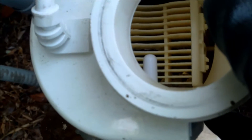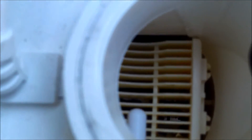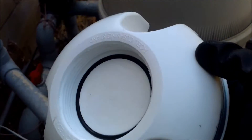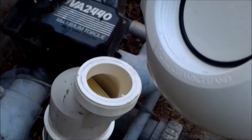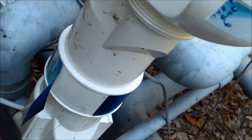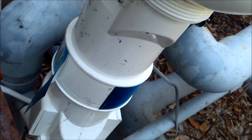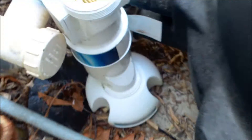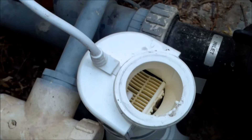You can see there's a little bit of calcium buildup right there in the center plate — it's kind of hard to see, but you can see some calcium in there. The cell stand has an O-ring and threads. We want to thread it into the part that's not where the cord is — we're going to do it on this part here. I'm going to thread this unit in; it should thread in fairly easy. I'm going to get it all the way tight, then place it down on a flat surface. You don't want to use the end where the cord is — you won't get it tight.